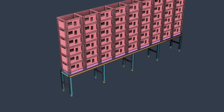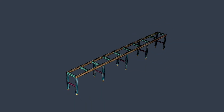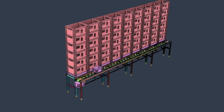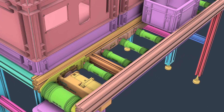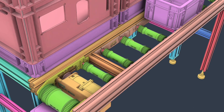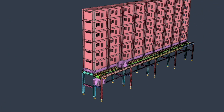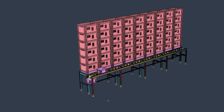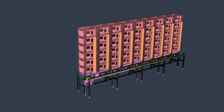The feeders are placed on a simple extrusion frame and the conveyor belt is attached to it. With the exception of the extrusion profiles, most of these components are printed. A whole series of smaller boxes will then move below the outputs of the feeder stacks — either magazines or simple pipes then load the boxes, thereby creating any combination of parts we want.